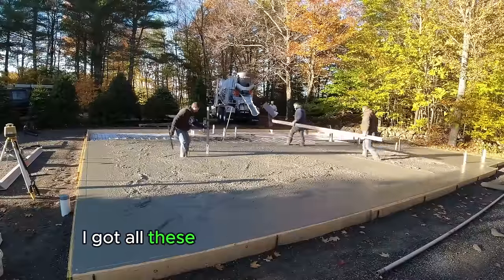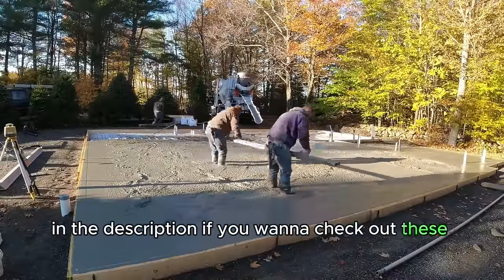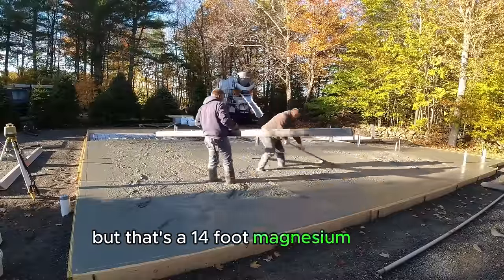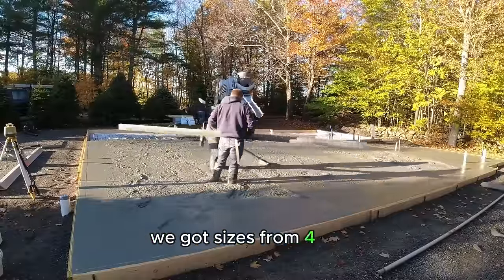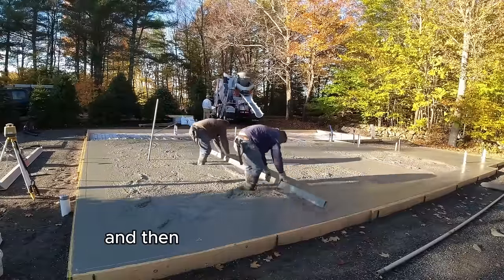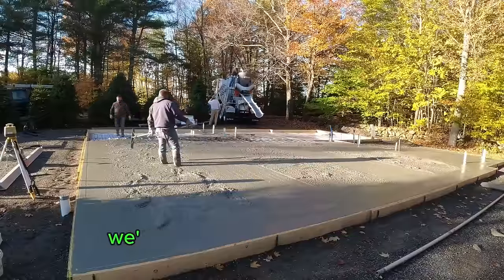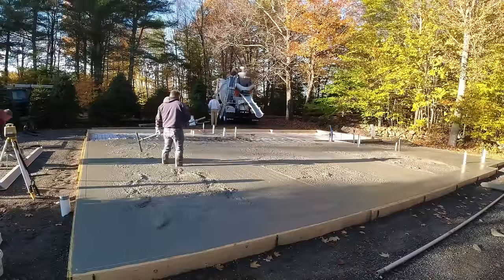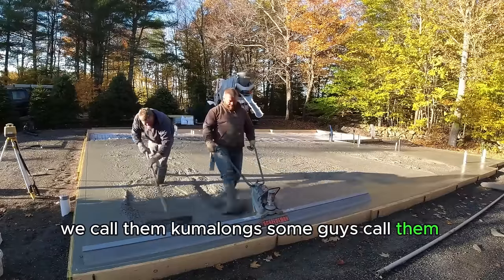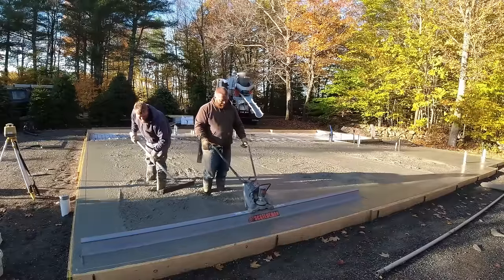I got all these tools listed down below in the description if you want to check out these tools and maybe get some of them for yourself. But that's a 14-foot magnesium screed. We got sizes from 4 feet all the way up to 14 feet in 2-foot increments. And then we're using the battery operated power screed. We're using a magnesium bull float and those concrete come-alongs. Some guys call them rakes, but really what they are is come-alongs.